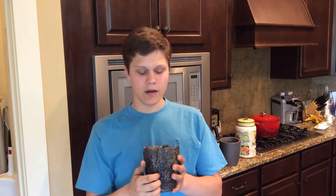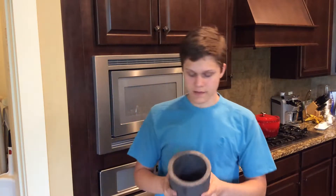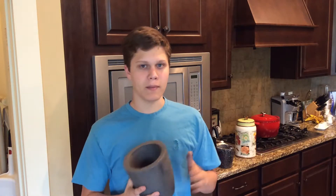This is my crucible — it's the graphite cup that I melt metals in — and there's a crack in it right here. It's falling apart and completely ruined, so I don't think I'll be able to use it anymore. We got a new one. This new crucible is the same material, but it looks completely different — it's shiny and reflective, and it won't break down as quickly because it has thicker walls. Before we can use it, I need to dry out any moisture that might be in it, so we're going to pop it in the oven at 250 degrees for about an hour.